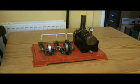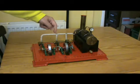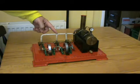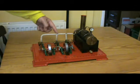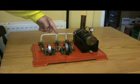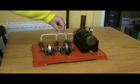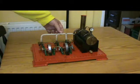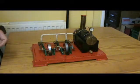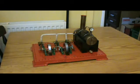The pipework is modified from the two SE3s. I tried separating the T junction so that I could join the two together at that point, but for some reason it just wouldn't come apart. I still don't know why. I suspect it wasn't soldered or anything like that, it was actually crimped. So I've made a join between the two pipes at this point. There's a little bit of brass tubing under the string here, joining the two, which is obviously not Mamod. That's one of the few parts of this engine which are not Mamod. The other obvious one is the string, which I put there for insulation purposes.